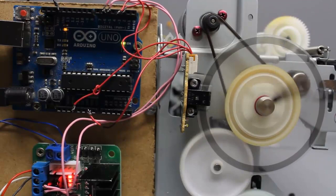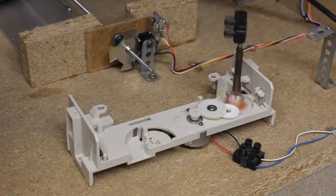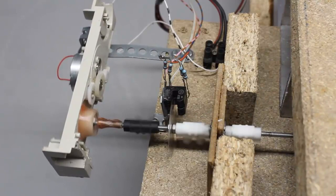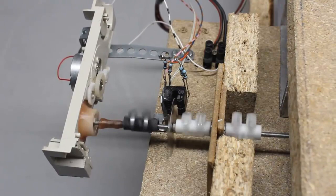Let's go back to the handmade encoders. For CNC machines, threaded rods are used to create linear movement along the axes. This geared motor is from an old optical drive — it usually opens and closes the tray. The sensor disk is attached to the threaded rod, so the clearance caused by the plastic gear can be widely ignored. By the threaded rod, the rotational movement of the geared motor is turned into linear movement.